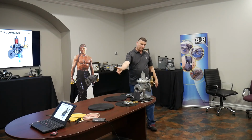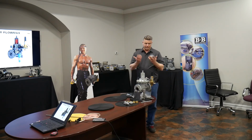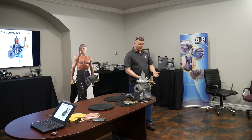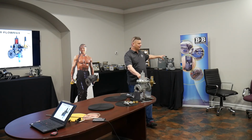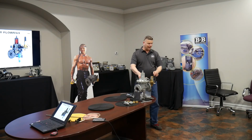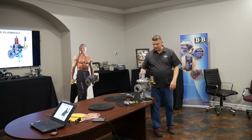So we're looking at that overpressure condition, and when the pilot sees that overpressure condition, it's going to lift the valve. This then would simply be a return into the relief stack, because when the valve is open, there's gas coming through this pin, because that's what the restrictor is doing, trying to rebalance. Which means if there's gas up here that's exhausting, we want whatever's coming into this chamber to join that and leave with it. You could put a bug screener here, something like that, but it'd be real hillbilly. Just run a line right here to the exhaust stack and handle it that way.